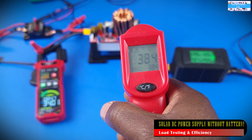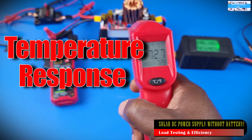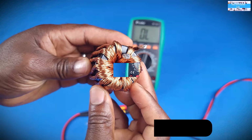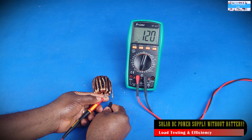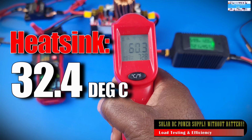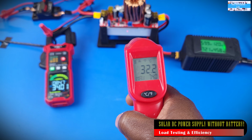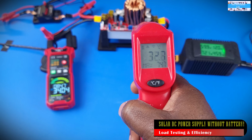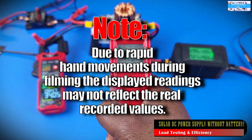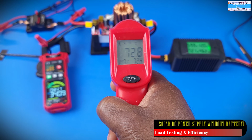Alright guys, and lastly, the final test that I wanted to conduct was to look at the temperature response of the converter overall, especially with no external cooling. And I purposefully did not add any external cooling fans because I wanted to see how much heat dissipation that's going to come out of the power inductor, given that we increased the inductance there. So overall, what we're measuring here is an average heatsink temperature of about 32.4 degrees Celsius. And for the inductor, we're seeing an average temperature of about 70 degrees Celsius, and that is to be expected because my goal actually is to kind of tune this inductor to act as a low value resistance that we're adding in series with the power that is coming in from the solar panel. And I'm going to be able to explain all of this in great detail in our next video.